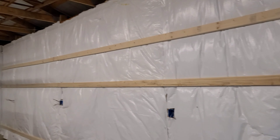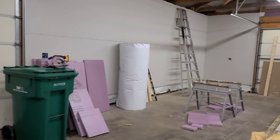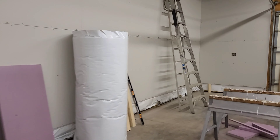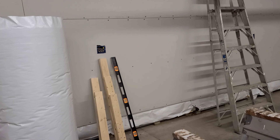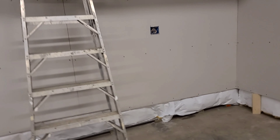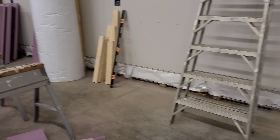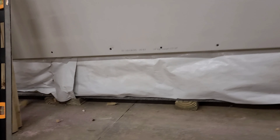We made a little more progress here getting some of the insulation bats up, nailing boards on. Worked on this back wall here, now trying to get this pink foam in and stuff it down right in there, get that nice and sealed up. After we get the pink foam in, get all our electric boxes ran and stubbed out, then run these insulation bats — nice big wide bats, they span the gap pretty nicely.